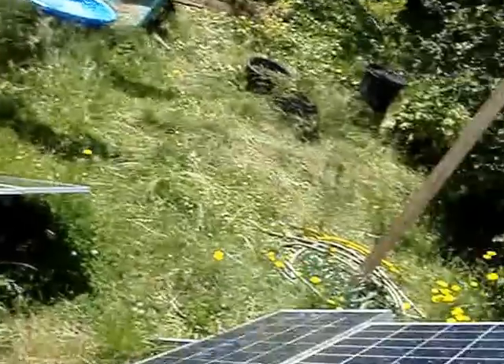It's kind of a little bit hazy out, but as you can see, I'm using the solar today, and I've made some changes to the system. I've added some gauges so that I can actually monitor the amount of power that I'm receiving from the solar, and I can monitor the amount of power that's going into the batteries. There are two amp meters and two volt meters. One amp meter is showing the amperes coming off these three racks out here, and the other amp meter is showing the combined amperage from those panels and the ones on the roof — the 255-watt Siemens monocrystalline and the eight Sunforce amorphous panels.